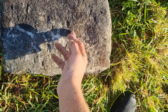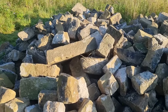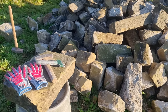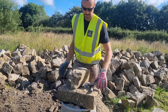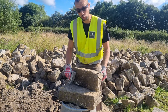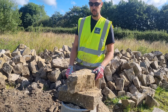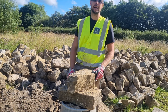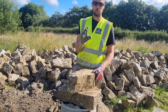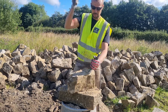It's called punch face because of the indentations on the face that the masons, when it was originally quarried, punched flat to remove any imperfections and give it a nice flat look. I'm going to set up my banker — which is my working barrel — and I'll work off that. Normal regulations are between 100mm and 140mm on the bed, but these have wider blocks at 125mm, which only leaves between 100 and 120mm on the cavity, so these need backing off to 120mm on the bed.